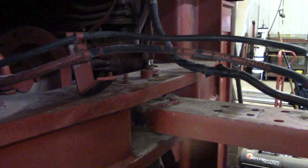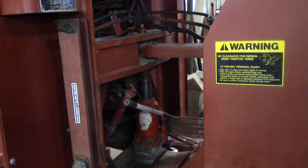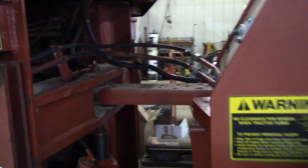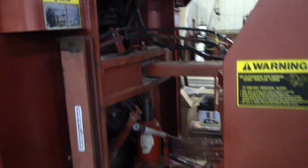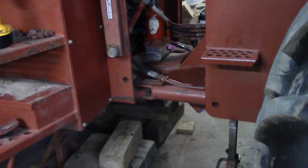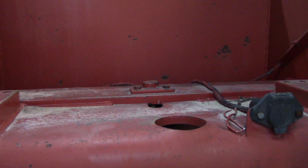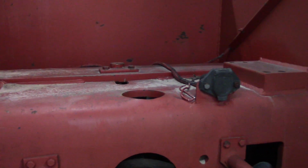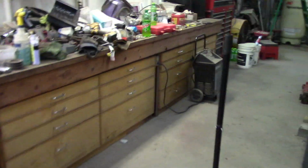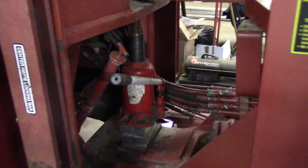Now we're dealing with the upper pin. This one does not have any threads, so we're in the process of finding a bolt. We're going to weld on the top, and with the bottle jack pushing from the bottom, hopefully we can get enough power combined to pull that top pin out, and then she'll be free, at least on the two main pivots here in the center. We still have to pull all the pins for the steering rams, but those pins generally, so far for us, have come out pretty easy. The last one we got here is in the back. This is the back of the top link. So up front there's a uniball and a pin, and then there's one at the bottom, and then on the other end of the top link is this pin here. You can see right above the rear axle. And we have them all, so we're going to change them all here on the 9150. Yeah, so far it went okay. We'll see.